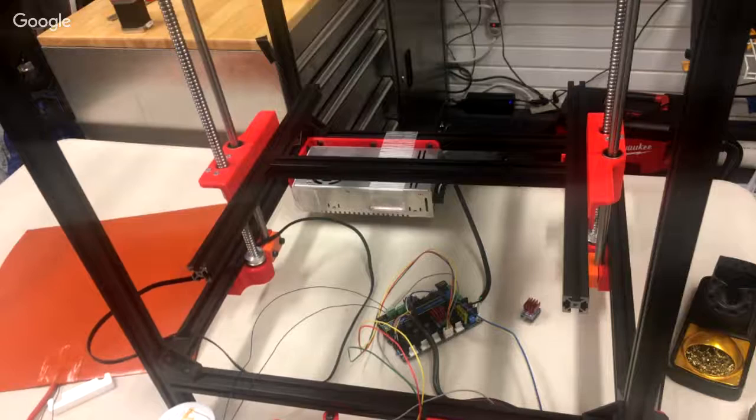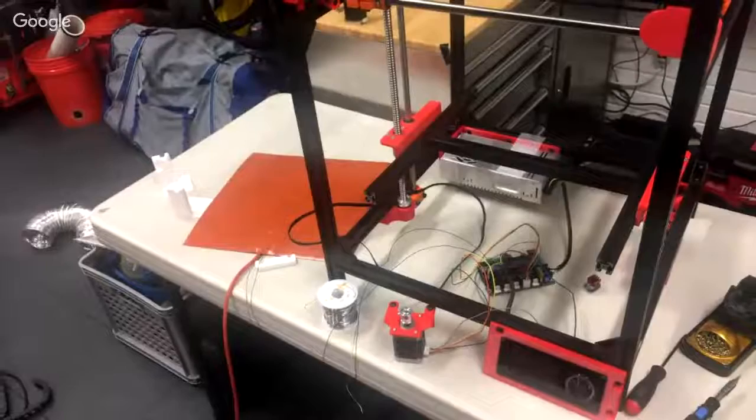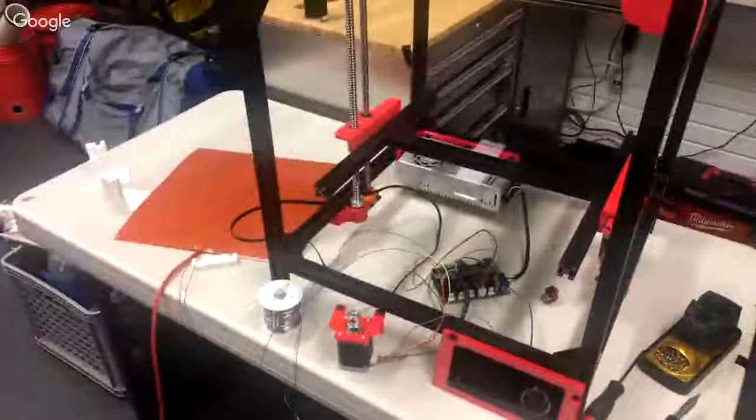My bed is an eighth-inch piece of cheap aluminum from the Metal Mart, eighth-inch, I can't remember what the grade was, 60, whatever. But what I ended up having to do on mine, and it's eighth inch, so it made it easier, is I figured out where the crown was, and I marked it with a marker. When I'd take a straight edge to it once it was heated up to temperature, I figured out where the highest spots were, and I brought it out into the garage with a block of wood and a rubber mallet and straightened it out. You'll have a lot more trouble doing that with quarter inch, but I think that it'll be flat enough for you. Are you going to be using glass on top?